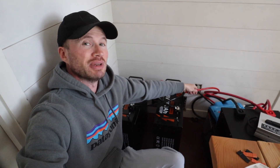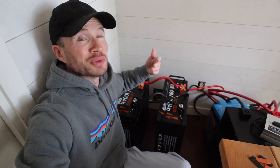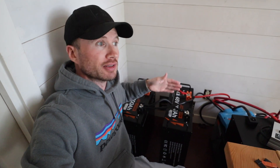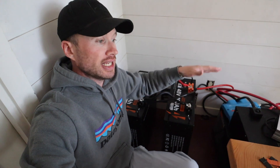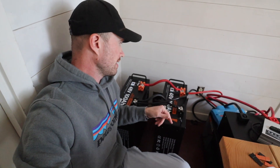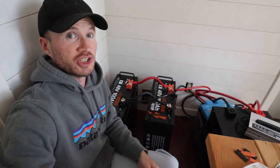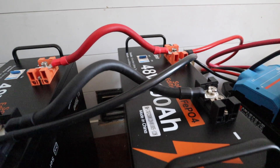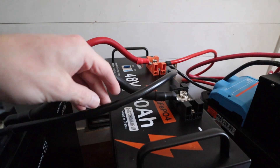I'm checking these cables out to make sure there's not any heat buildup. With them being smaller cables there's more resistance of the energy flowing through the cable, which creates heat, and I'm not feeling any. I'm going to keep checking back on this over the next few days to make sure there's not any dangerous accumulation of heat. Hopefully there won't be any and the system will be good to go as is, in case I can't find the better cables I'm looking for.